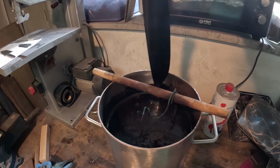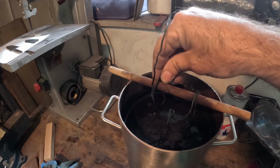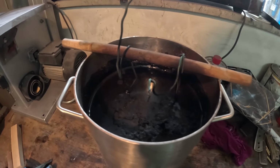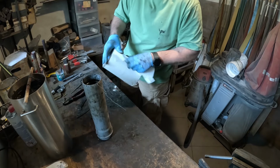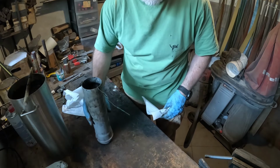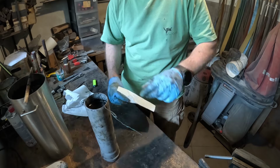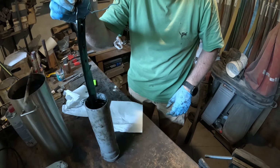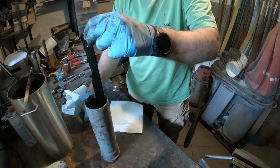This patina will prevent a little bit of rust on your knife. But, you know, it doesn't mean that you can leave the knife in the water. It will rust nonetheless. So let's see what happened in the coffee so far, because it's not an exact science. So if it hasn't been etched enough, we will repeat. But yeah, you can see, it's all black. It's like crazy.